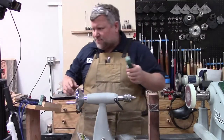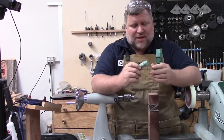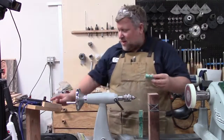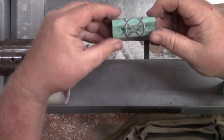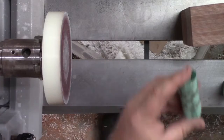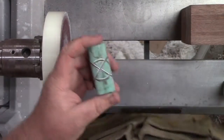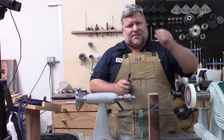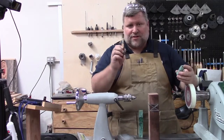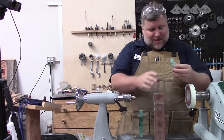The magic of videos here is I prepped one two weeks ago when we thought we were going to do this, so here is what it looks like. I haven't turned this, but I sanded it — I literally just took my blank and rolled it on the sander to get this. And what's cool about it is you can already see the pattern starting to come through. Now this is a big, open pattern because it's a 45-degree angle. If you wanted it tighter, you might do 40 or 35 degrees to get the angle you like. When I first did this, I made four different ones of different angles to find the one I liked most — I think it was 40 degrees. This is 45, so this is open, and it's perfect for like a pepper grinder or a handle.